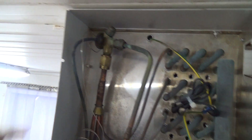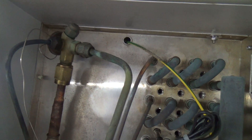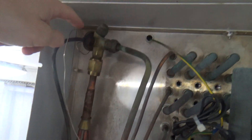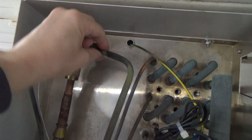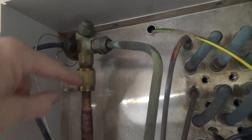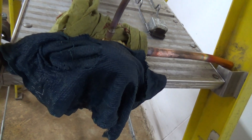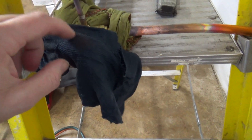Back out here again. I think it's probably an R22 valve — we're going to put this on R449A. We might put a stub on the valve before we put it in here. I'll probably put a quarter-inch stub in and then put a connector down here — it'll be easier to braze it in there. Then we've just got a solder adapter to go on here. It's got a bit of a twist in it — that's just twisted the last bit of pipe. It was leaking around here; it's probably got a copper gasket in there that's gone out of shape. We'll get that brazed in. Always put a rag around everything so you don't melt it — you could melt that in the blink of an eye if you're not careful.